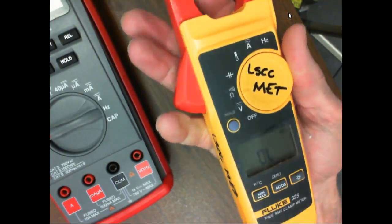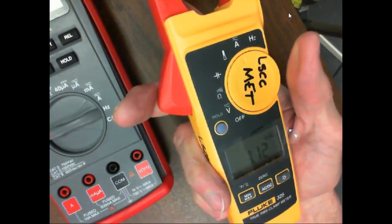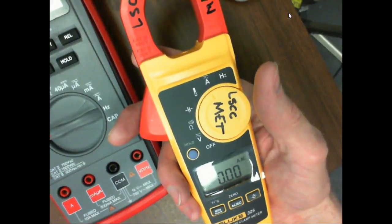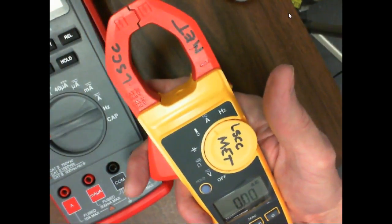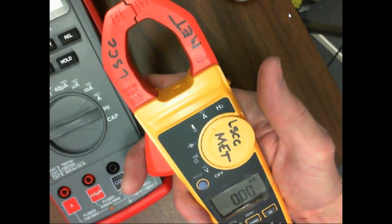select. Usually this is an auto ranging meter. And what it's doing is, it's not an ammeter, it's a clamp-on ammeter. So what it's doing is it's measuring the what? The strength of the magnetic field. Most of these will only measure AC because we have to have motion, and AC automatically generates what we call motion to make these things work.